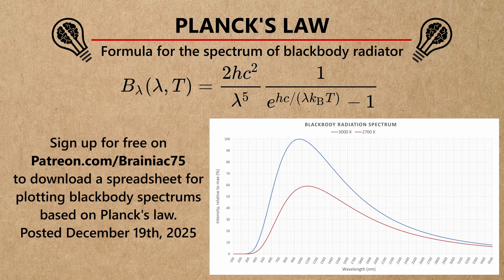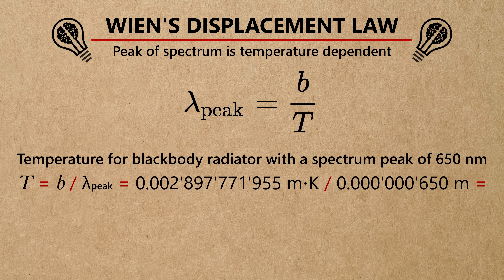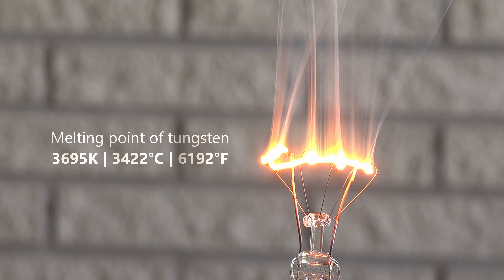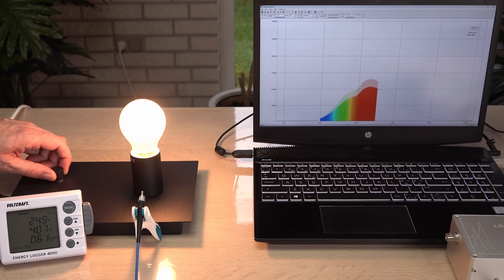The shape is not a perfect match to any blackbody temperature. But finding the peak of the spectrum — around 650 nanometers in visible red — equals a temperature of 4500 kelvins! That can't be right. While tungsten does have the highest melting point of any pure metal, it would still turn into a liquid at 4500 K. Not a great start.